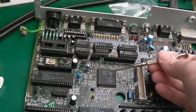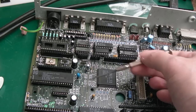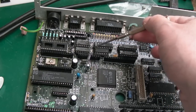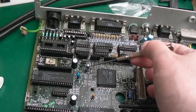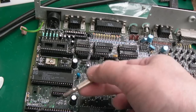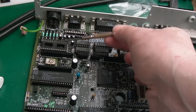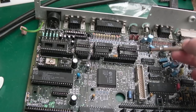And then further up here now, the IOC reflowed all around it, replaced all of these little SMD components here. I replaced the ones down there as well, by the way, and all of the caps up here because they were really bad. Lots of traces tinned up here, little bits of nail polish, brand new caps, brand new tantalums, that was an original cap. We cleaned up all around here, brand new socket, that was socketed.